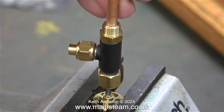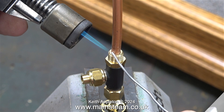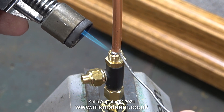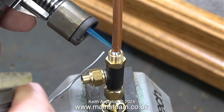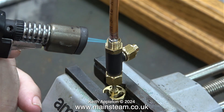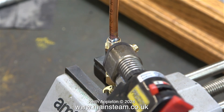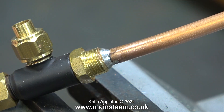I've lightly clamped the valve in a very small vise — it's quite a useful tool. I'm using this excellent small Proxxon blow torch to heat the area where I need to solder. With a job like this it's important to get the heat just right: if I heat it up too much the paint's going to bubble, and if I don't heat it enough the solder joint will be poor. I'm using electrical multi-core solder for this, I find it very convenient. I left the heat on for a while to make sure all the solder flowed into the joint, then cleaned up the joint using some Scotchbrite. Here is the result — a very neat soldered joint.